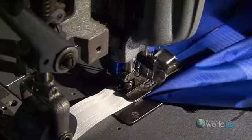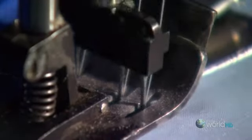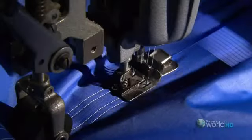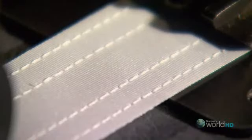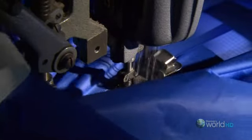The pieces are sewn together with a unique sewing machine that uses two pairs of needles — a total of four needles — to stitch the seams. The multiple needles are needed to make a stitch called the four-needle chain stitch. This type of stitch is able to flex in the wind to prevent tears, and if one line of stitching pulls out, the other three will still hold.